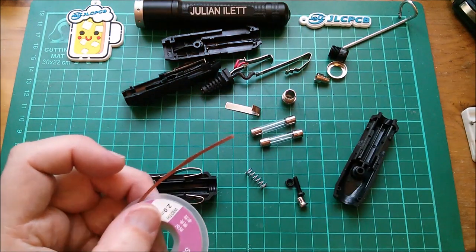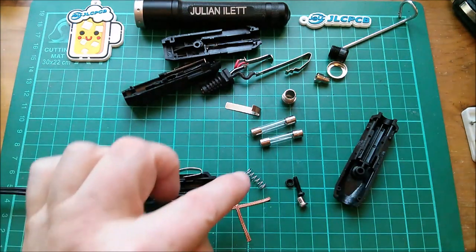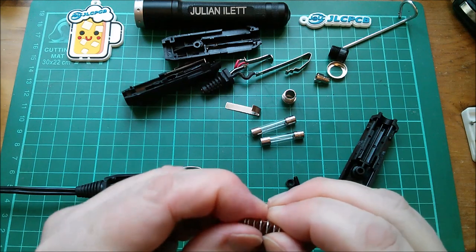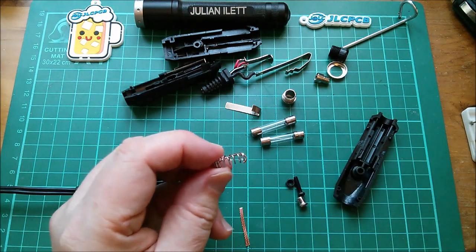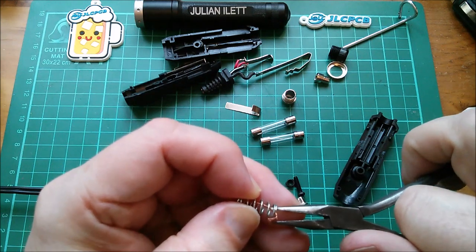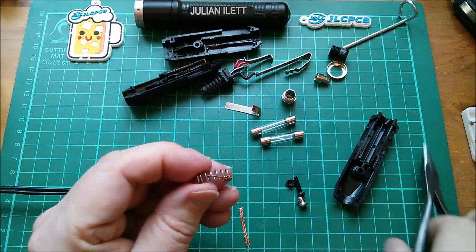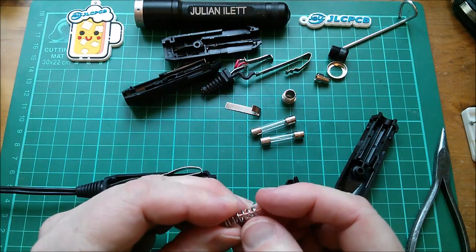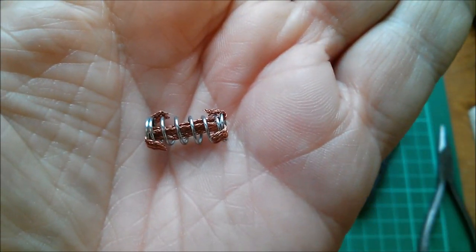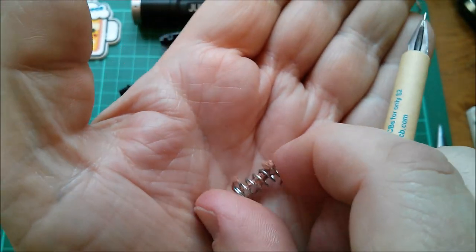Now for the clever stuff with the copper braid. It doesn't need to be that long, just a bit over an inch maybe. I'm going to use two pieces and thread them up through the spring, and just sort of bend them over the end — like this, and then fold them over. It's a little bit more springy than I had hoped. I'll need the pliers, because I want that fold so it clamps around the end. It's all fraying and splaying now. But I want two of those, so let's put the other one in and bend that over. So that's my mod: to run a couple of pieces of copper braid through the spring, so that when the spring closes the copper braid can close up with it, providing the conductivity to prevent the spring getting hot.